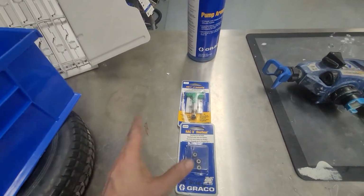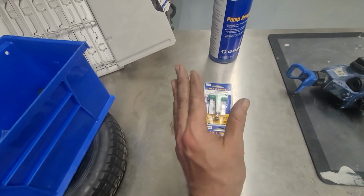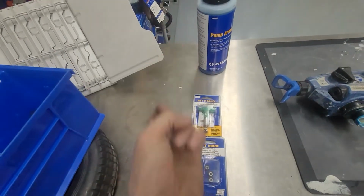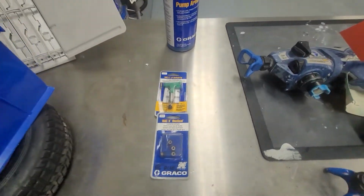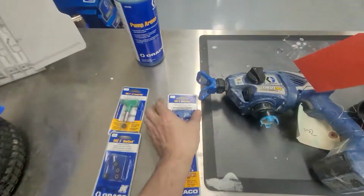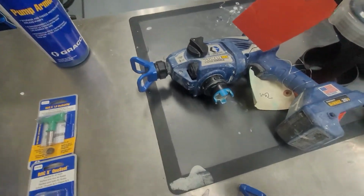And you'll get a slight thinning of your fan because it has so much velocity, and you'll get these kind of bigger speckles of overspray. With this, if you do it like this, you'll get a line, okay? A streak of paint.